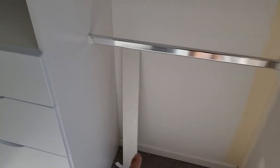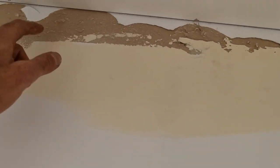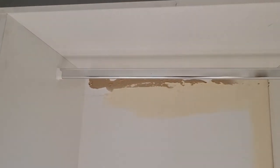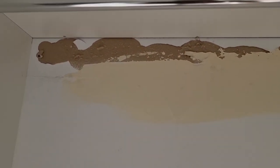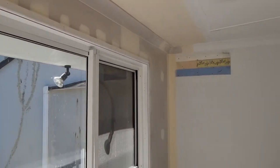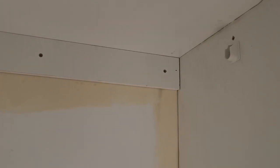That arc has ended up looking alright. Now going to put this melamine up here. Behind this is a block wall, so I've got some spaghetti, some liquid nails — liquid nails and spaghetti behind that — and then screw that in. And then that will be it for up here for finishing off all the small pieces. That's installed there, and then I'm just going to go through and check these caps and all those screws.